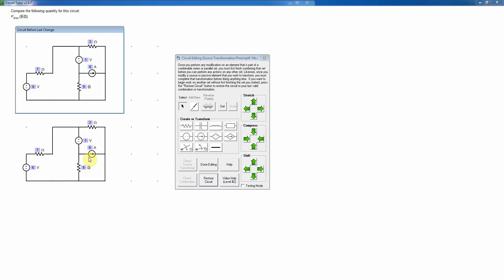Looking a bit more, I notice that if I transform this source, that will put a current source and resistor in parallel with the three-ohm resistor — notice how that comes down here and then the other end is over here. So I'm going to transform that into a current source. Notice I've got the wrong polarity by default, so I need to fix that to point up. Then I'll put in the value: 6 volts divided by 7 ohms gives 0.857 amps.